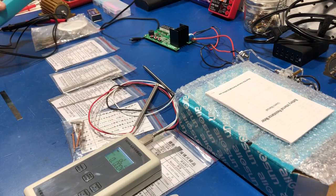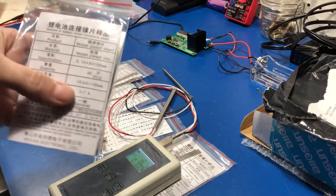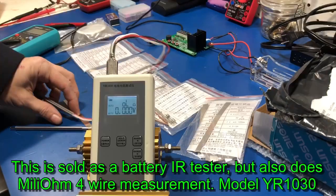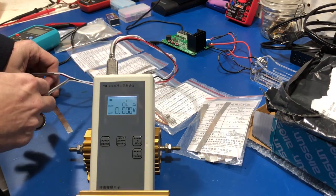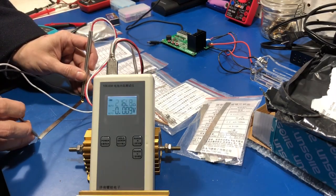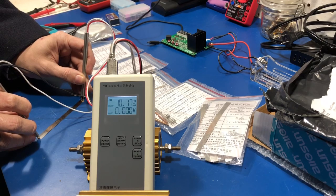I got the AllSun EM3610. This is a strip of nickel-plated steel, 10 milli-ohms for 100 millimeters. We're going to take this piece of nickel here in the back, which is 10 milli-ohms from front to back, and it measures as 10.17.